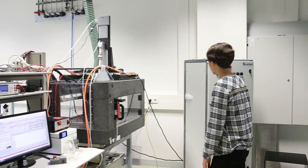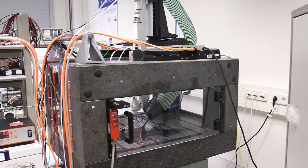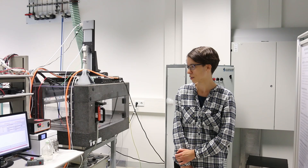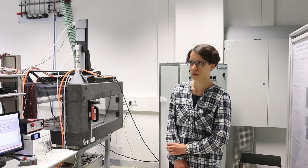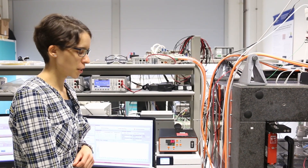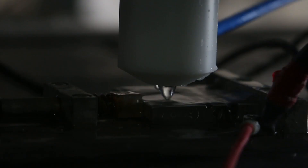Our process energy source is from Ralfaard Schaltanlagen Systemtechnik GmbH, and we can use voltages up to 600 volts. For the experiments, we used a nozzle diameter of 5 mm and a working distance of 6 mm. Our electrolyte has a temperature of 80 degrees Celsius, an electrolyte flow velocity of 250 milliliters per minute, and consists of ammonium sulfate. Now I will show you the experiment for jet PEP — I start the temperature control and then the process energy source.